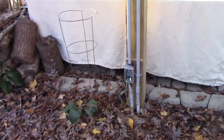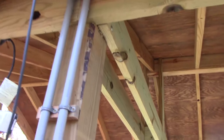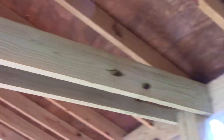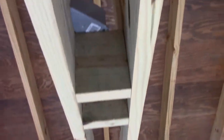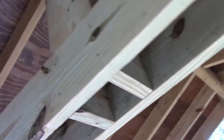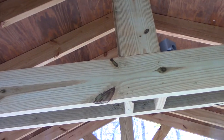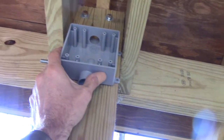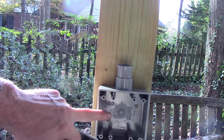So today we're back out here — it's been a few weeks and it's leaf blowing season, so there are leaves underfoot and everybody is blowing them. I'm going to run conduit from over there where we come up across. I'm going to take that box and install it up above so if at some point we want to come out of there and do a ceiling fan or other things in the ceiling, we have a way to get out of the conduit. I'm going to bring the conduit over, install this box up here with outlets for TV, cable box, etc., then bring that conduit down here where I've already installed this box — we'll have a switch and an outlet.